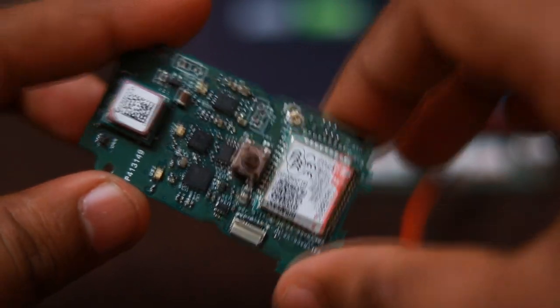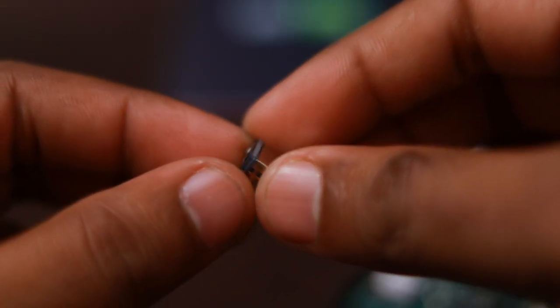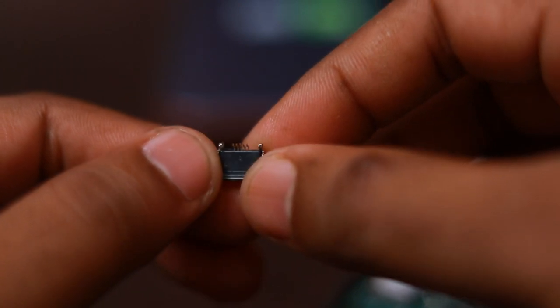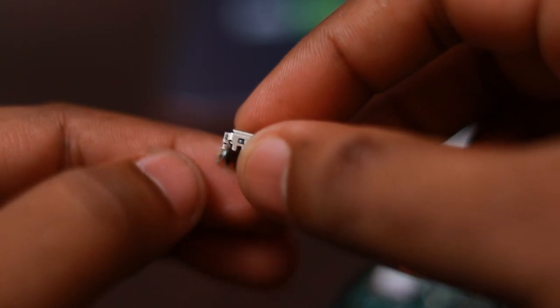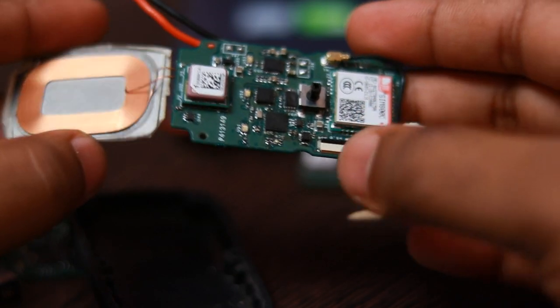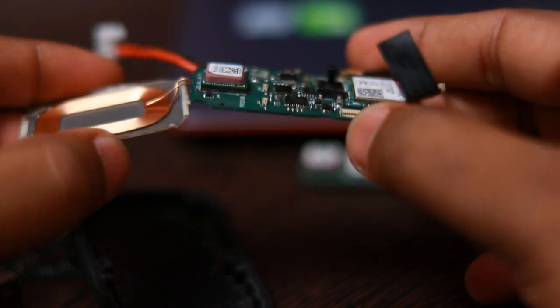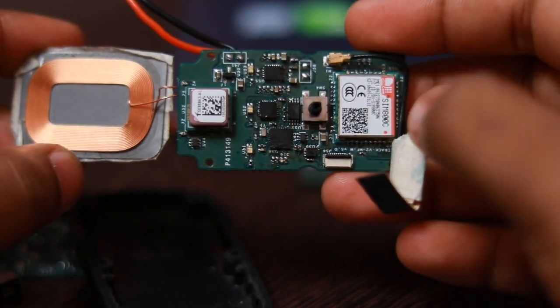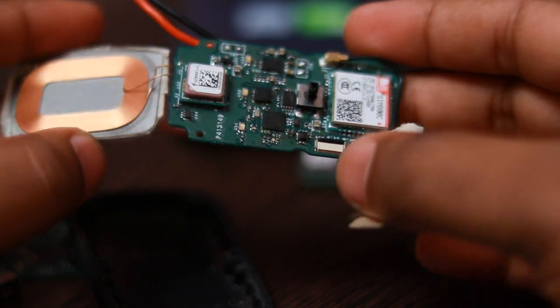I gave a lot of thought and even considered using waterproof micro USB connectors for the charging interface. This would mean that I need to create a custom cutout in the enclosures on the sides of these boxes, and the PCB alignment would need to be perfect — which was painful and didn't seem comfortable to design. That's when I took the call to add wireless charging to the design, which makes life a lot simpler. Of course it would also mean the user needs to be provided with a wireless charging pad too, but it's worth it.